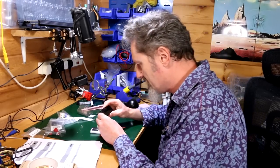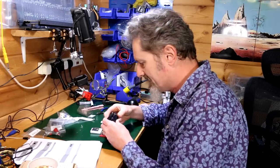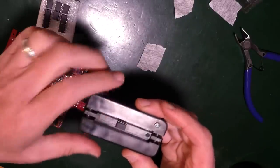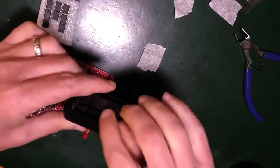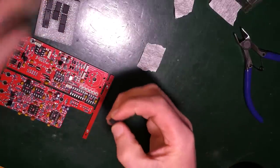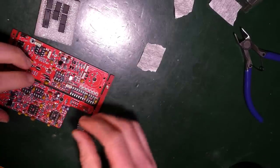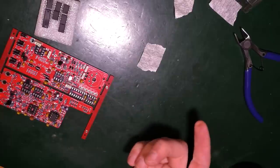My other tool is a leg straightener. So you see this here, I should be able to put my IC in here and I should squeeze it. And that should straighten those legs. So it should pop straight in. Because, you know, previously I've been rocking it on the side of things and trying to push it and bend it to get it right, but this should just do it. So that goes like that, and it does. It's the right size.